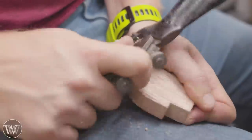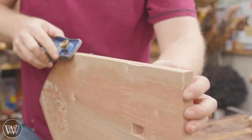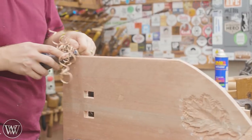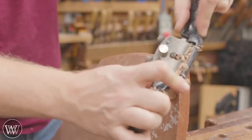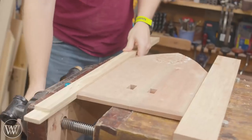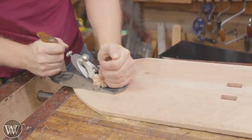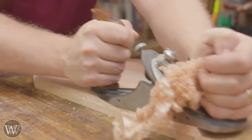I'm going to break the edges and chamfer them down just a little bit so it's not square and matches the outside edges. We were thinking about doing an ogee profile but a simple chamfer actually worked pretty well. With the cross grain here you want to skew the plane so it doesn't blow out the grain on the end, but for everything else it's a block plane on the sides and a spokeshave on the rounded edges to make that chamfer match all the way around. Then the last thing is the final smoothing and cleaning up on the surface. I came in with my finest-set smoothing plane, cleaning it out and smoothing it down to get a really nice clean surface. Very happy with how that came out.